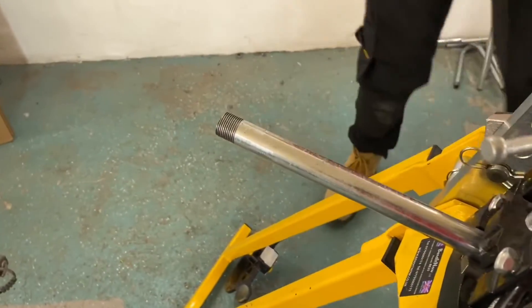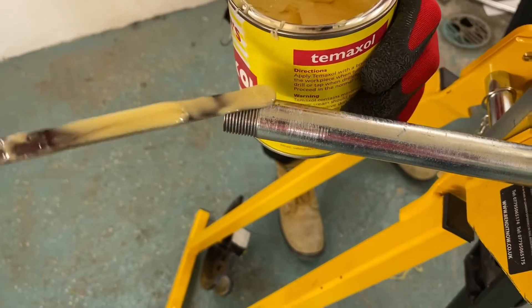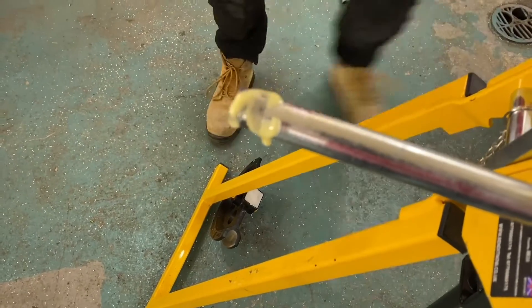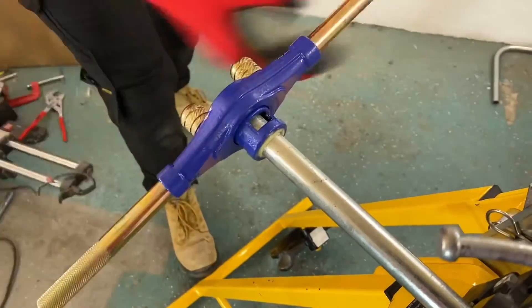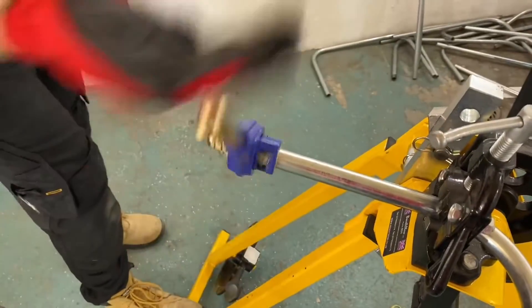There's quite a lot of threads to go on. What's going to happen to the threads that are going to be left exposed — what are you going to have to do with those? We're going to put some galvanising spray on those so they don't rust. Because we had threads on it there's no point going in dry so we're going to extend those threads out. We've shown a separate video on how to thread steel conduit and again that is in the playlist in the description.